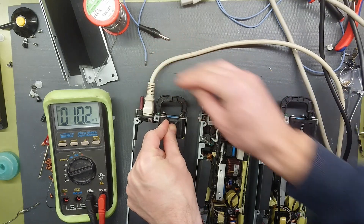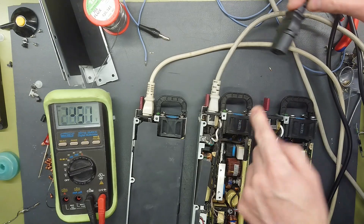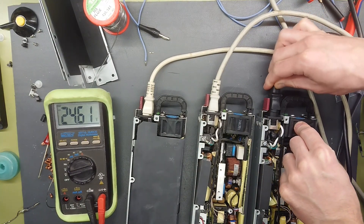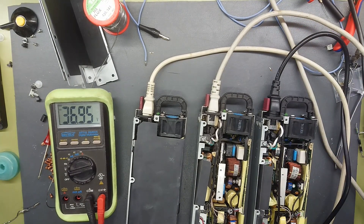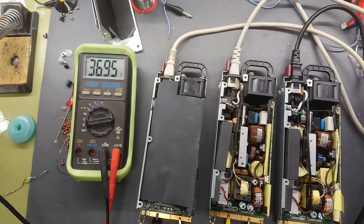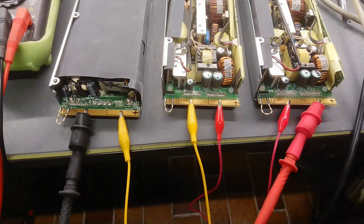This is the first power-up test. We can see here the first power supply makes it go to 12 volt DC, plugging in the second goes up to 24 volt DC, and plugging in the third power supply we are up at almost 37 volt DC as the power supplies are unloaded. The three power supplies are put in series, but it's just connected with crocodile clips as this is purely for a voltage measurement with no load on it.